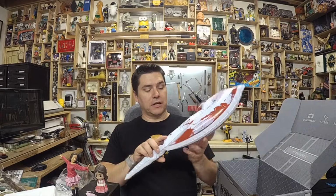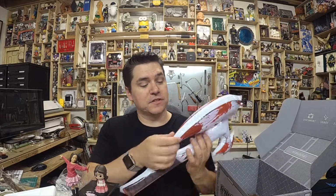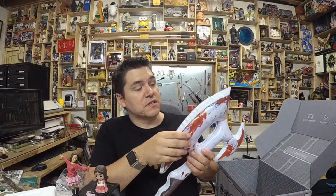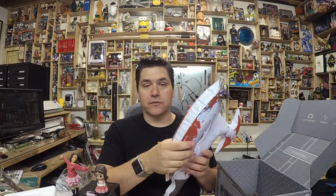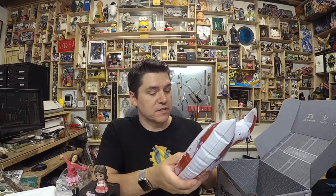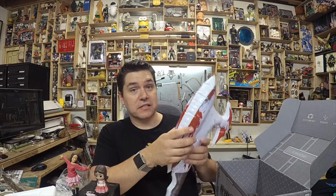It's a simple sonic weld. I don't know how many of you out there know much about the manufacturing process of this, but since this plastic is so thin, they can't use heat to close it together. So they press the 2 pieces together and use ultrasonic sound to melt the edges together, and then they die cut it out, which I think is kind of cool. That's why it creates such a solid seam there. If they had used heat, you run the potential of it actually melting the plastic itself. So they use a sonic welder, is what it's called. I think it's kind of cool.